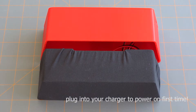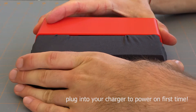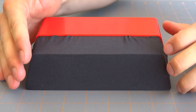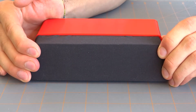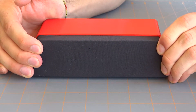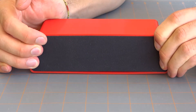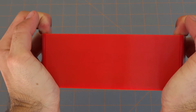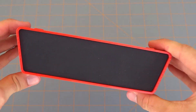Once you've checked it all works and turns on fine, you're ready to slide that inner housing into the outer casing. First, make sure you're not going to snag any cables as you push it in, then just gently pull it all the way to the rear of the enclosure. Also make sure that the connectors aren't going to be touching the passive radiators as that will cause some buzzing. Providing you haven't caught any cables or the capacitor on the charging board — which you can bend out of the way — you should have a nice even lip around the entire perimeter.